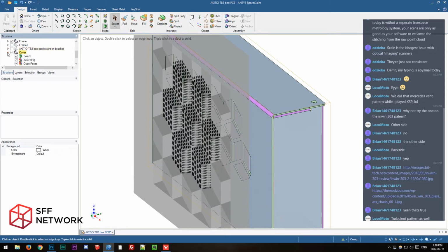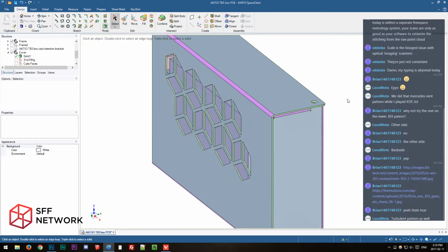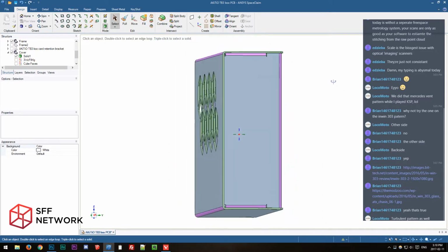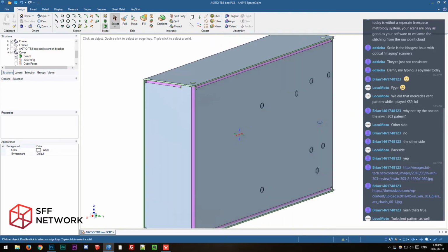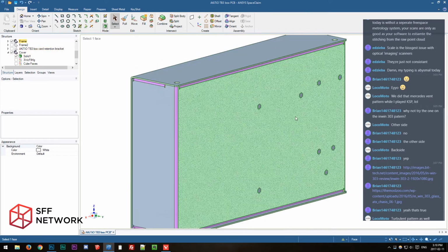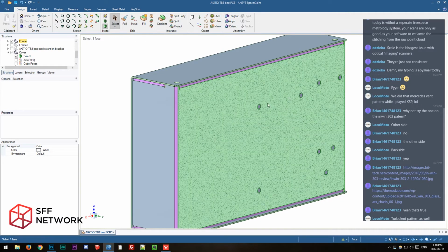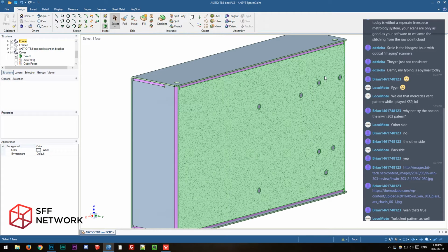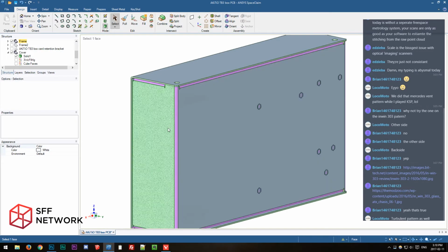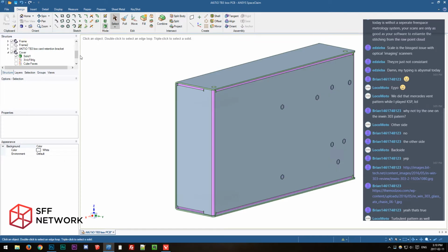Oh yeah, it just has the pictures that I was using as reference. Okay. So if you look at it from the front, then you see the bends and the relief cuts, and it just doesn't look very pretty. And the standoff holes here look really bad, but in reality it won't be very noticeable because I'm assuming that this would all be powder coated. So the powder coating will hide where the standoffs are pressed into the metal.